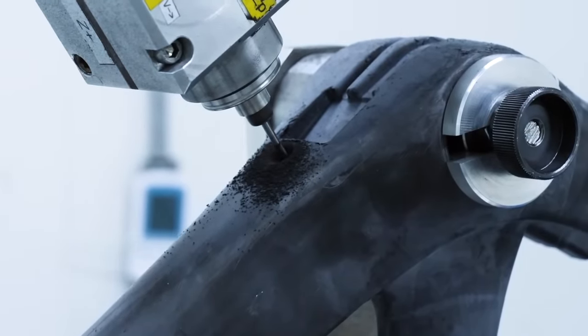So the material manufacturers add in toughening phases and toughening mechanisms. These can be as simplistic as small rubber particles included within the matrix. There's always a downside with adding these materials: it can reduce the thermal capability. So very tough resins can be difficult for us to use because of some of the surface temperatures that we have to put up with. But that seems to be one of the biggest advancements, and certainly matrix toughness has come on a long way.